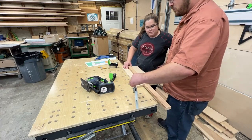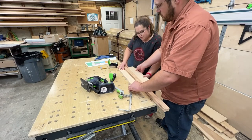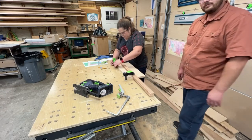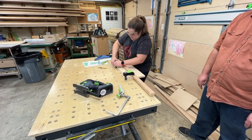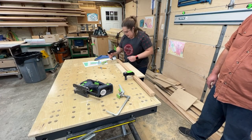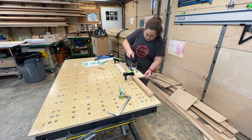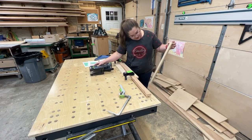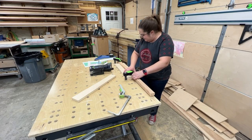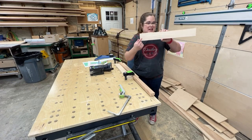When my line didn't go quite to the edge for me to mark the offset, I just lined up the straight edge with the line and gave myself a little mark — that was Robert's suggestion, but it works. I would have to clamp my straight edge here and somehow still get my clamp on this tiny little piece. Robert suggested just clamping it all at once, making sure where you're going to cut is overhang. Well, I have made my first mistake — as I was going, this scooted a lot and was no longer marking my guide. I'm going to call it about three eighths of an inch off at the end there.